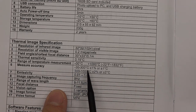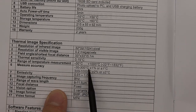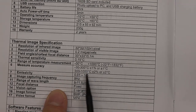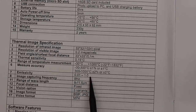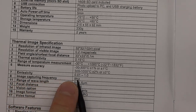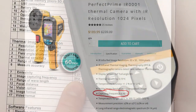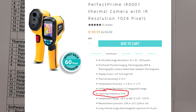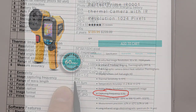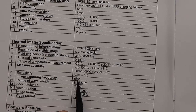The accuracy is noted as about 1% or 1 degree C up to 300°C, and 2 degrees C up to 1000°C — we'll check that. You can set the emissivity. This works at 9 Hz. Other cameras in the Perfect Prime range I've seen operate at 6 Hz and tend to be a bit slow, so having this at 9 Hz works reasonably well, though it certainly has limitations. The camera has a fixed focal distance and is shutterless — many cameras have a shutter that clicks across to calibrate, which can be irritating. This one just continuously works.